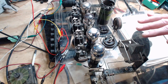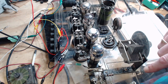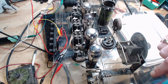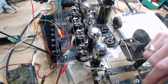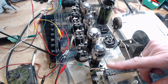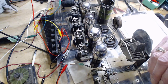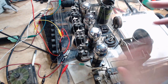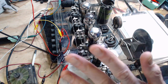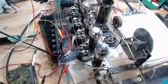It's just not possible. So that being the case, then we take the local oscillator, mix it with the incoming antenna signal somehow, and then just fire it into the first tube. Try to mix it in the first tube. Its only hope is to make this mixing occur in the first tube. And the tube has to operate in some non-linear fashion in order to display out harmonics. And that may happen just from piling in signals onto the grid. It just may be enough.